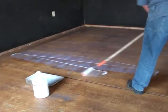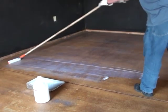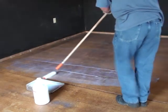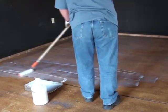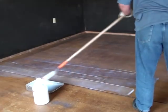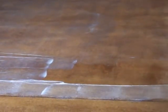That way you get more of a good, even coating. You are going to apply two coats of sealer, and you're going to use a quarter-inch nap if you're inside on a smooth surface, and a three-eighths inch nap if you're outside on a broomed, rough, or porous surface. You do not want to seal in extremely hot weather — seal in the cool part of the day so the sealer won't dry out too fast and you'll get an overall better sealing job.